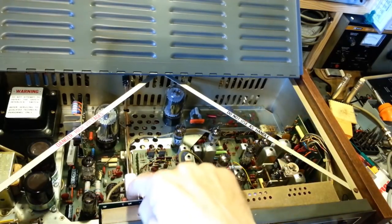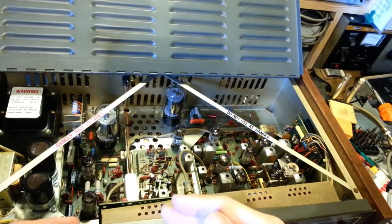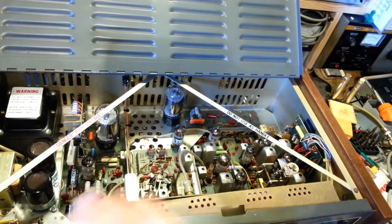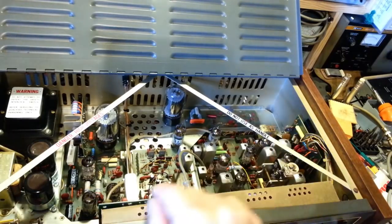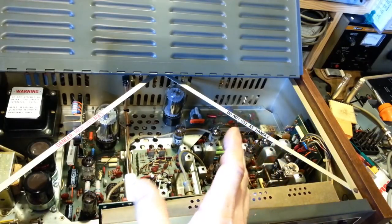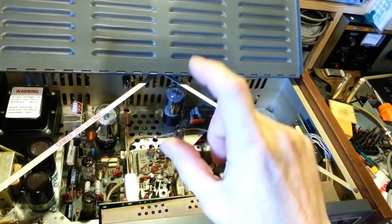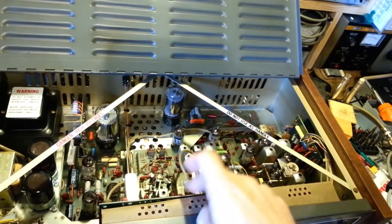And just the fact of doing the alignment a lot of times, the crystals will start to work again. It doesn't mean they need to be replaced, that they're weak. They just sit there and hum along for another 30 years just fine. And like I say, every crystal you could see originally, earlier in the video, where I was flipping through channels, had the spectrum analyzer on, and you could see... I think I had the scope probe hooked up to the output here, to the B output.